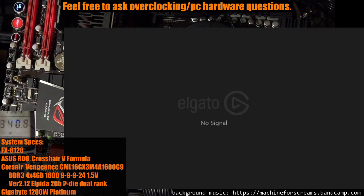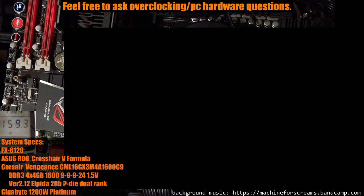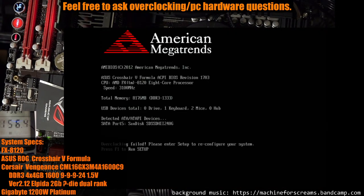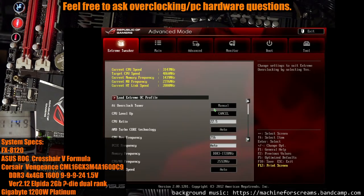Oh no, it's doing the Asus board thing of it just will not recover this time. You know, I should take a look at the Elpida and the Hynix and Samsung timing straps, because I think that would be kind of interesting. I don't actually know how much of a difference there is between them. I would imagine GDDR5 default timings are probably pretty similar to the DDR3 JEDEC situation, where the default timings are just kind of the same for everyone, like JEDEC 1600 is 999, or if you're really bad at making memory chips, it's 11111.